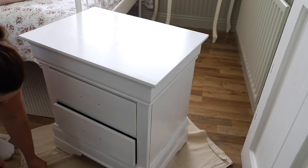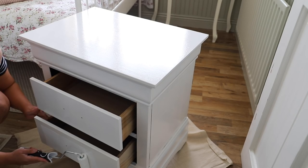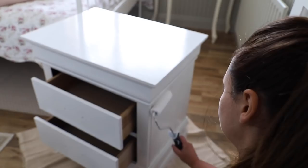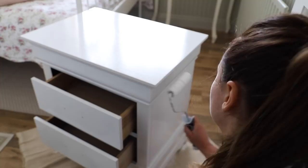When it comes to applying my top coat, I generally do two coats and follow the drying times. Bear in mind that when painting a dark piece white, white can be a little more transparent and you may need an extra coat — though not always. For this piece I only needed two coats of white to get the coverage I wanted.